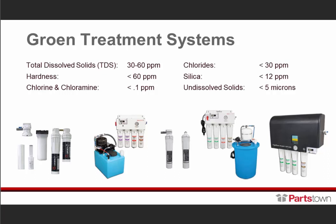We also have an FXTT Plus CR, which is only for reducing chloramine. So if your water quality is great except for the chloramine, you would want this filter. And then we have the Smart Steam treatment system that is only a scale reducer. The majority of our other systems are RO systems. When the TDS exceeds our water quality standards, that's when the RO system comes into play. Note that RO systems do not remove chloramine — it's a gas and it just passes right through.